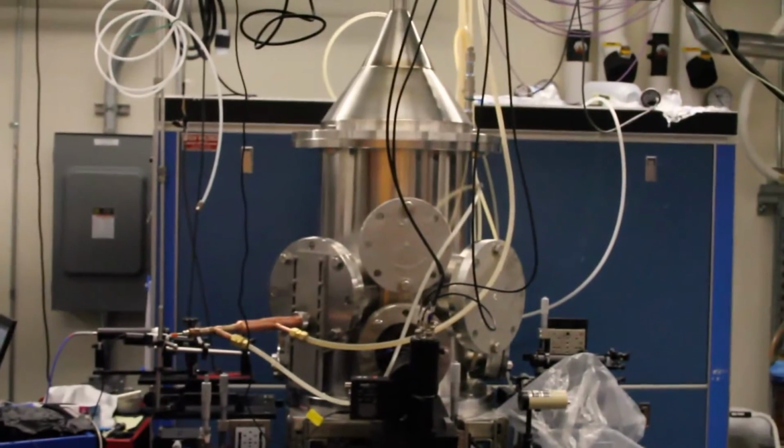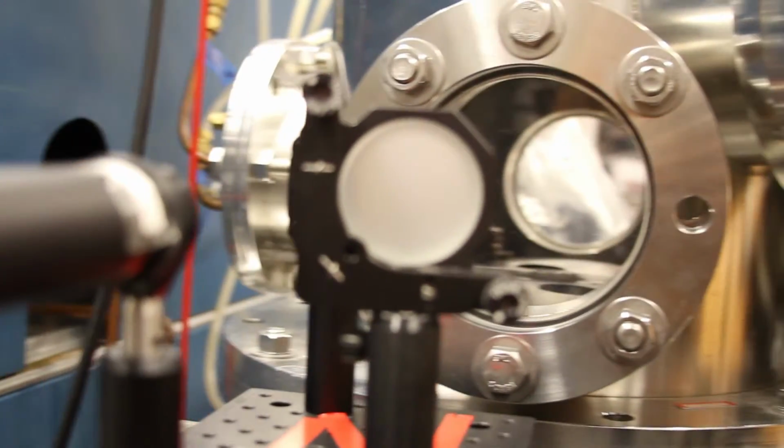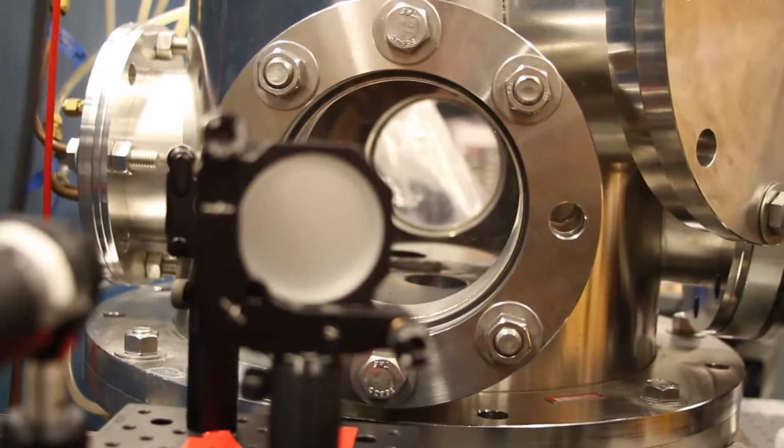The Plasma Test and Diagnostics Laboratory has a 30 kilowatt inductively coupled plasma torch, which is used with various gases to simulate atmospheric reentry. Our team was asked to design a probe which can take emission measurements at various radial locations in the plasma jet. Previous emission measurements were taken through a window with the optical elements located outside of the torch.